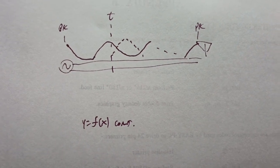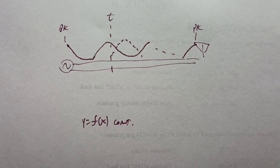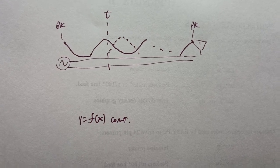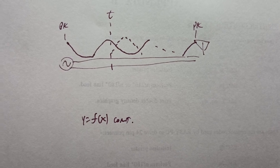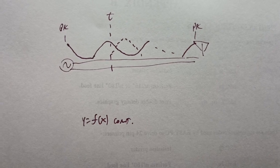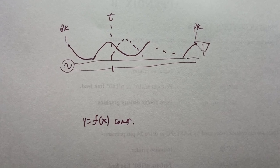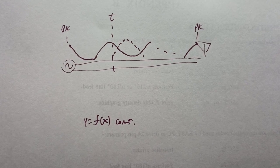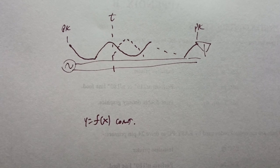So I guess the short answer is it's necessary to get the transmission line in multiples of half wave, and preferably exactly, so that we get the reading at the transmitter with the fake SWR meter that's as close to what it would be at the feed point, not counting transmission line losses. Because realize there are two losses, one forward, one reverse. The energy is traveling both directions over the same line with the same losses. So the indicated so-called SWR at the transmitter will always be less than what it is at the feed point.